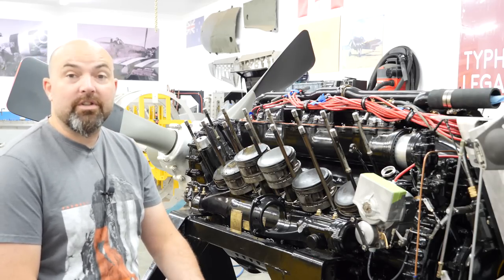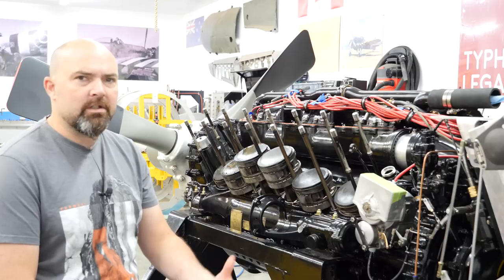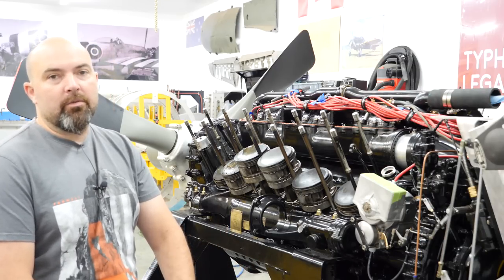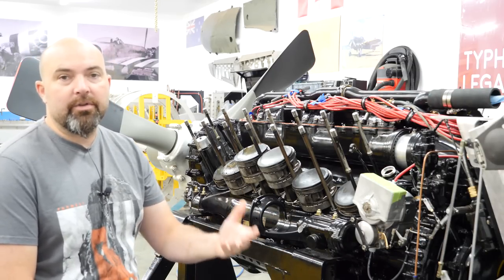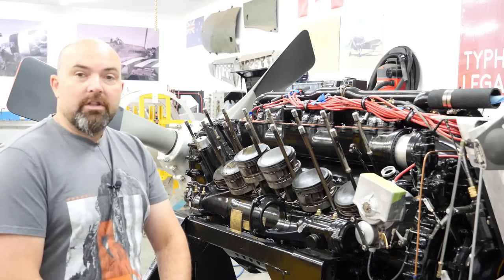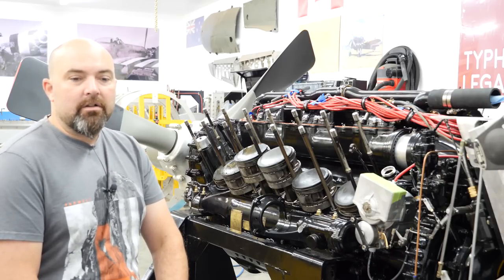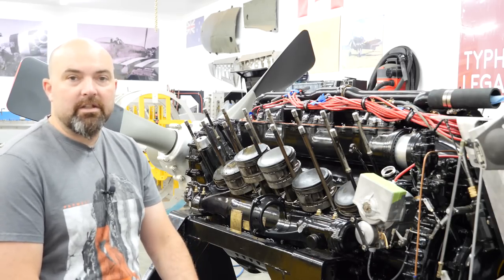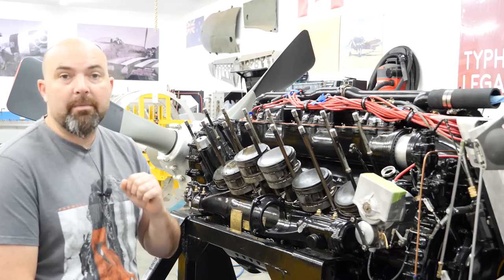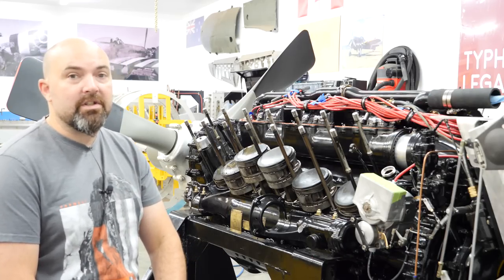We investigated further. We took the oil filter off. It's about a 2-liter capacity in the oil filter. It was all water. And we found further on down the line, right down into the tank, was also filled with quite a bit of water. So the bad news is that our oil priming tests and the speeding up of that oil priming pump actually meant that we were pumping water into our engine, which is not good.